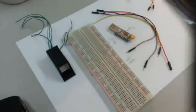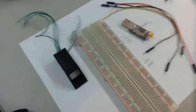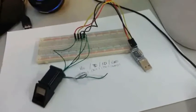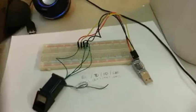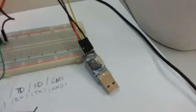Now, to test it with the PC, we would be using the following components: the ZFM scanner, a breadboard, a USB to TTL converter, and some wires. Next we'll be discussing the connections between the ZFM scanner and the PC. For this test we would need a USB to RS-232 module. This particular one is a PL2303 module. If we turn this over, you would see the pin config: 5 volts, 3.3 volts, TXD, RXD, and ground.